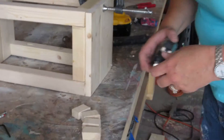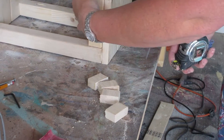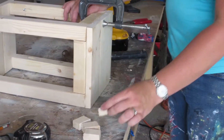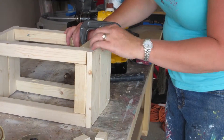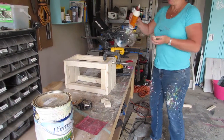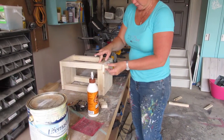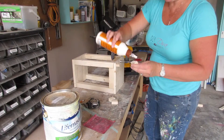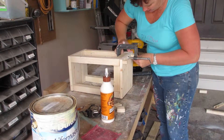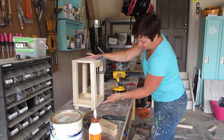Before we started filming, I cut these little tiny legs for the bottom — they are one inch by one and three-quarters. It was just leftover wood, so it can be anything. You're not going to see them, but if you're using your lantern outside, the legs will keep it from sitting in moisture, because otherwise the wood will rot and any paint or stain will bubble up. Having it just a tiny bit off the ground is going to protect it and make it last longer. We're going to go with the trusty glue — I put them inside a little bit so you can see them slightly for decoration, but not close enough to notice they're not sanded or stained. In this case, they'll also cover up my screws that are sticking out. We're going to let that dry — the weight of the lantern itself will press down on the little legs so they'll adhere.